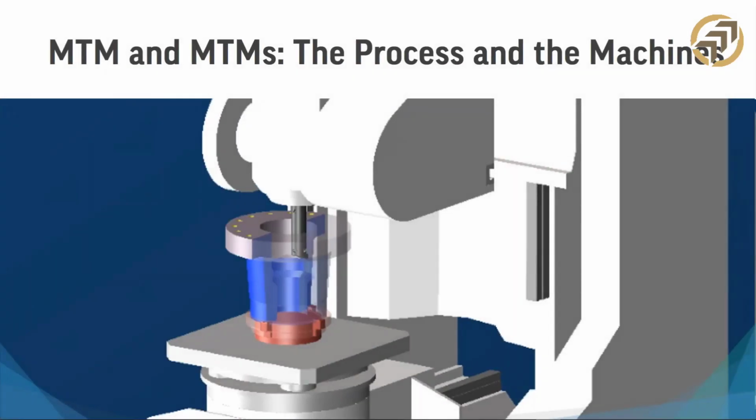So let's talk about multitask machines. At its basic level, multitask machining involves some milling on a turning machine, right? So mill turn machines are capable of both rotating a workpiece and rotating tool operations such as milling. It cuts by turning, the part is turning, and when it cuts by the tool turning, that's milling. Just to get that out there so we know the difference.